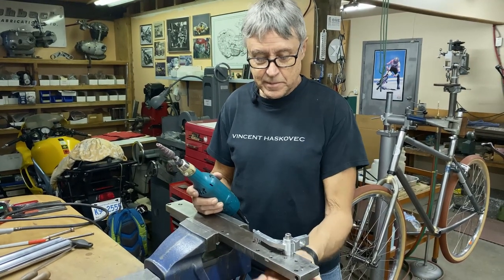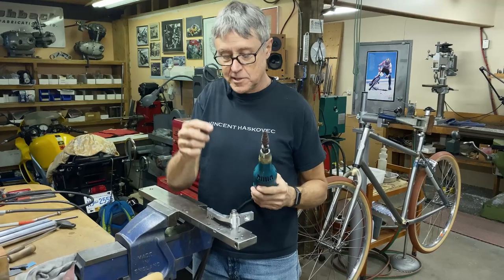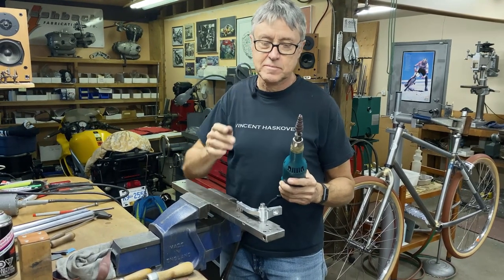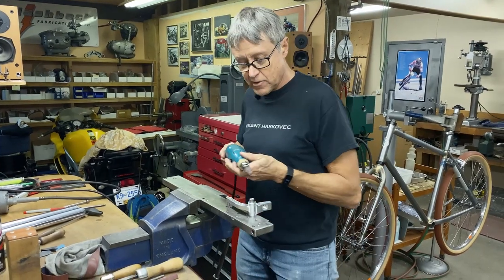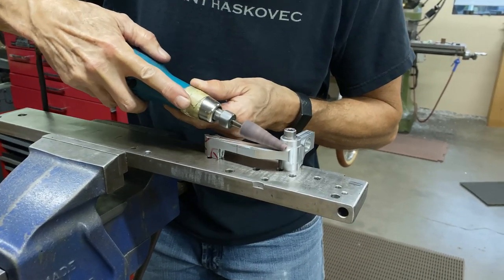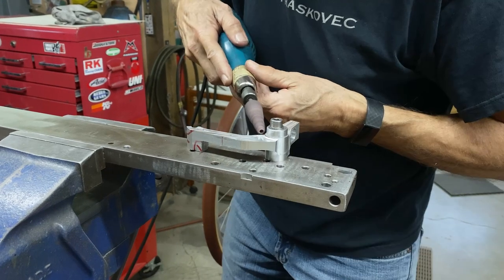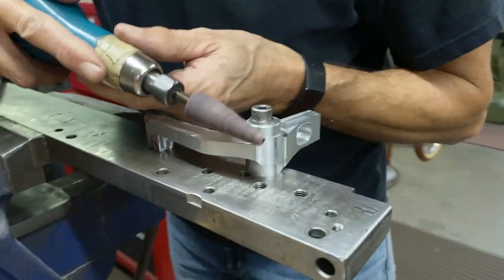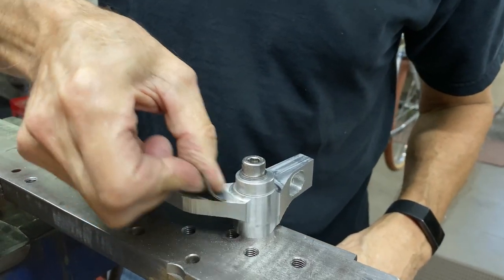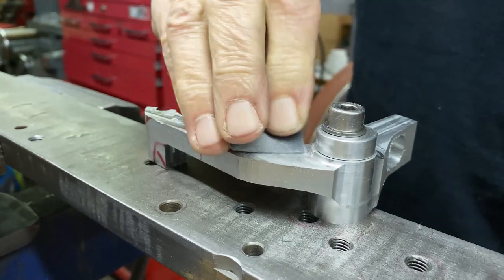I've got the arm mounted up on a piece of steel. I've got my high-speed grinder with a spiral roll — this one's worn and that's what I want, because I'm going to use the very nose of it to blend that in. I could do it by hand, but if I'm careful, this is easier and faster. Then if I take a little bit of 180 paper and spend a few minutes there, you can see how it'll all polish out — it'll get quite smooth in there and you won't be able to tell the transition.